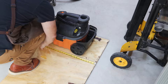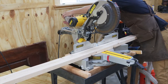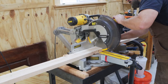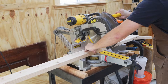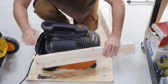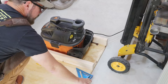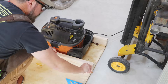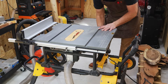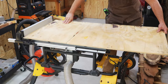I'll use my shop vac as a size reference so I can start measuring out and building the frames for the top and bottom tiers of the cart. I'm using scrap wood left over from the shop build. Once I get these 2x4s cut to length, I can use them alongside the shop vac to reference the width I need to cut the plywood down for both tiers. I'll make sure everything is nice and square, then take it over to the table saw to cut the bases for the top and bottom tiers as well as the piece that's going to hold the bucket in place.